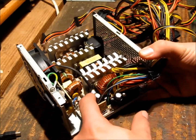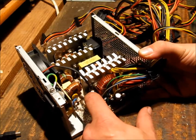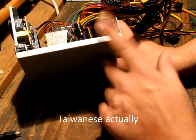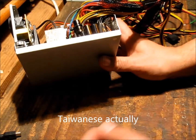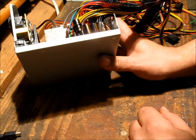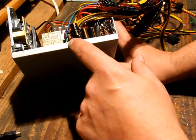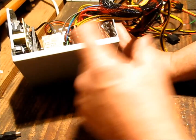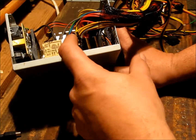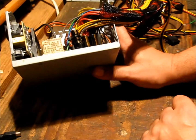We've put those 4,000 microfarad 16-volt capacitors in. They're from a manufacturer called Hitano in Japan — probably not as well known as other Japanese brands, but still a good brand, and they are low ESR rated as well. They're just a fraction too big, so I've had to use insulated sleeving to stand off the end one, and I've cable tied it for strain relief off of the wiring on the side.